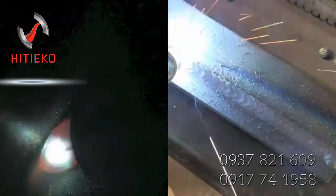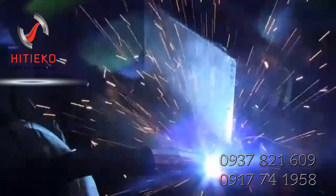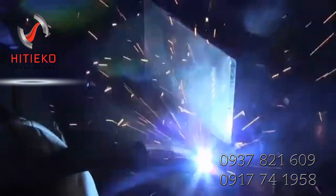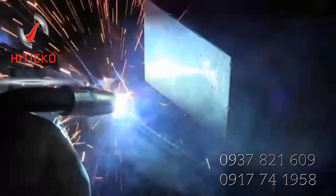We don't have much room to do much manipulation of the gun here, so oftentimes with something like this you might just do a straight drag, a straight push, or a little stitch back and forth — or forward and pause, I should say.